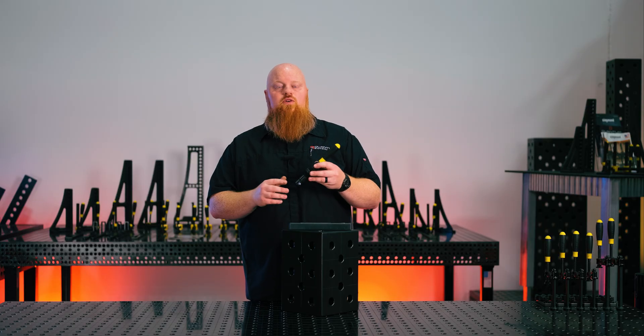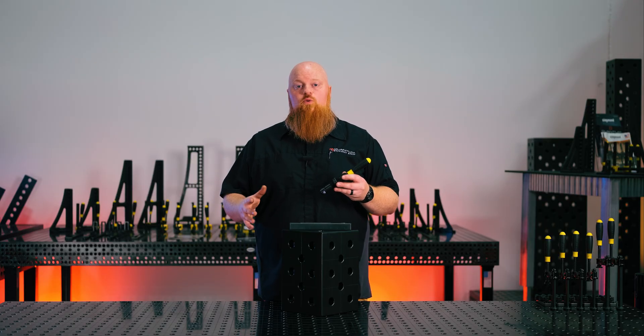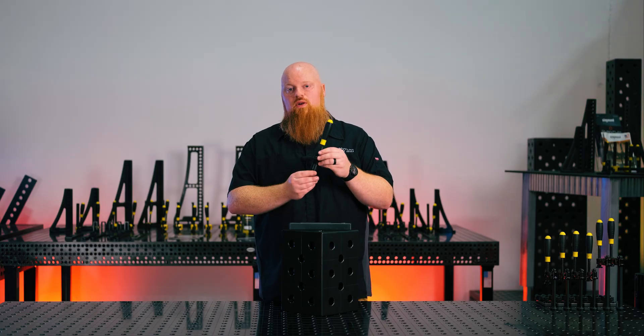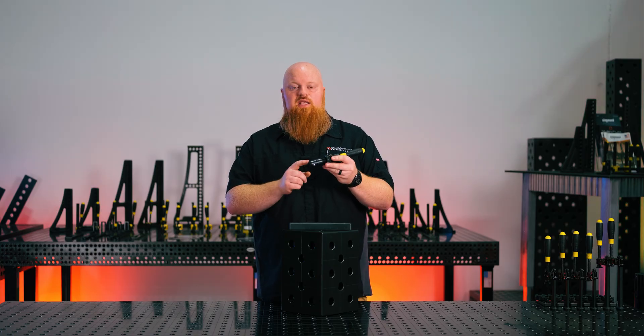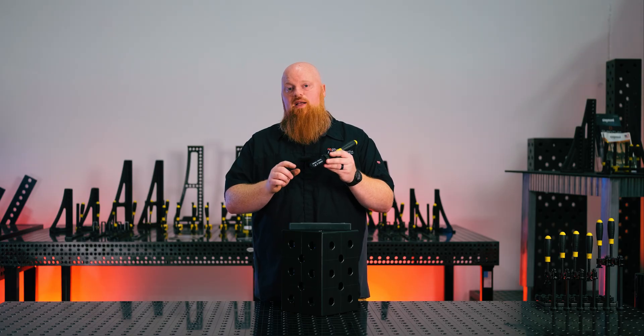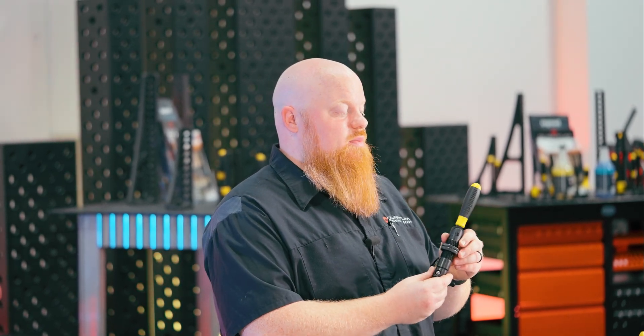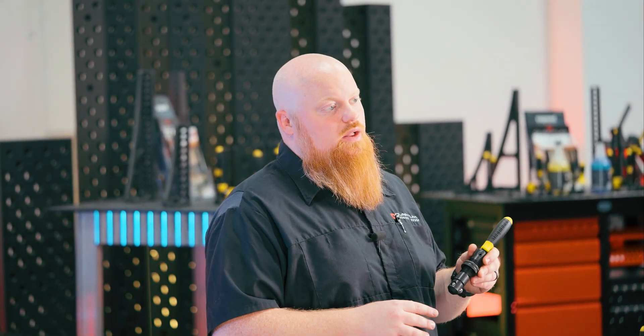Another big use for this is if you're laser or plasma cutting plate and you want to bolt the plate directly to the table without using professional screw clamps. As long as the plate has a hole big enough for the 28mm shank to pass through, it's going to work. Since it's adjustable in depth, you can go from half-inch plate up to three-quarter-inch plate and bolt it directly down. Just adjust the knurled thumb nut for the depth of the material and clamp it right down for quick welding on the table.